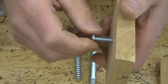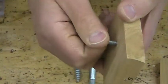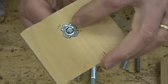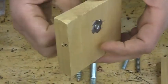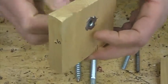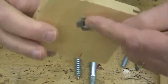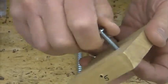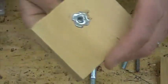It's actually stronger than the threaded insert because there's no way you're going to pull this through. On a threaded insert, if you pull on it hard enough, that could tear out conceivably. But it would take an awful lot to tear a T-nut right through the wood. So these are very, very strong — the downside is that the other side has to be an area that you don't see. If you've ever seen a climbing wall in a climbing gym, very often that's how they made it. They take a piece of plywood, drill holes all over it, and pound in T-nuts on the backside. Then on the front side, they screw in their different hand holds — that's a common use for these things, among many others.